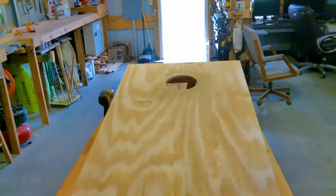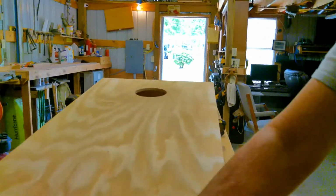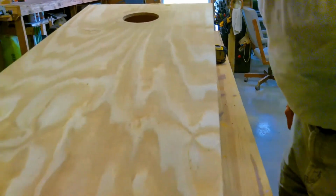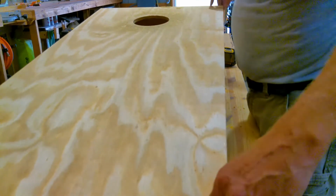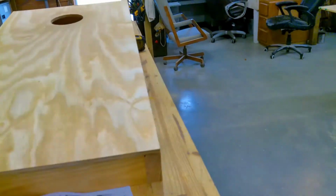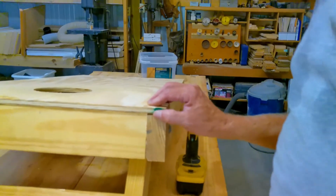So we'll go ahead and clean that up a little bit, and then I do see that this is just a little bit out of rack, so we're going to have to rack this one in. What I mean by that is if we're not quite square, because lumber does this, we will start out attaching this along this edge. If I line this up perfectly, top, bottom, and side here, then I can walk around on the other side, and when I look at this end, I can see that my plywood's hanging over a little bit here. I don't know if we can catch that.